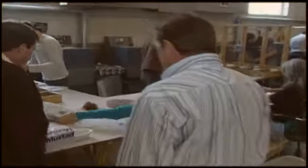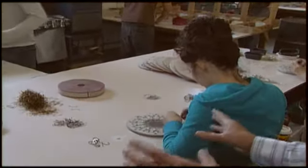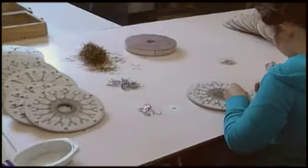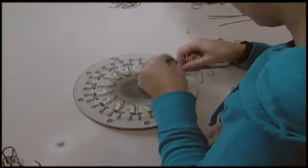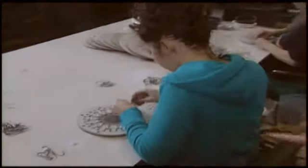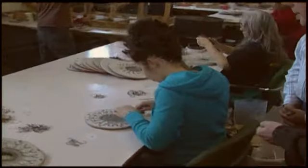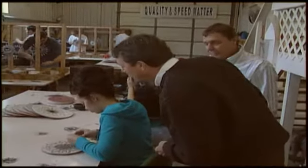These are centrifugal casting machines. Some of them are sitting idle. When you get busy, you'll call in more people and you'll have these working as well. The process starts over here with the mold. We can see what she's doing right now — she's picking up an empty one. The workers are sitting here putting all the supplies into the molds: hooks, wires, and whatever is necessary. They'll put all the hooks in there, and she knows, based on the order she's received, what size hook goes in. We've already pre-pulled out all the different supplies necessary for all the different items she is running.